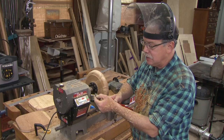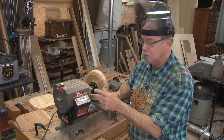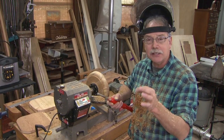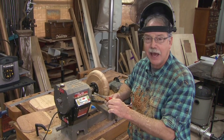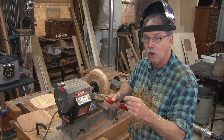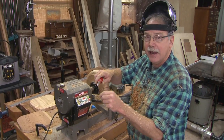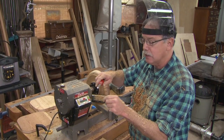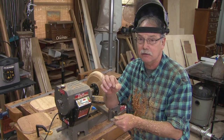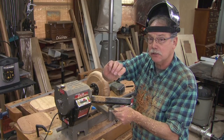And what happens is that's a nasty gummy mess on fine threads, especially as the cutter would heat up, it bonds to that metal. So the easiest way to release that Allen without stripping the head out is to get out a match, light that match away from any flammables, and hold it right on that Allen for about 4 or 5 seconds. And then what that does is it plasticizes the lignin, makes the glue less sticky, and you put that Allen wrench in there and you can ease it right out.